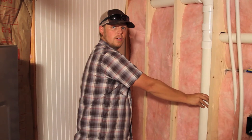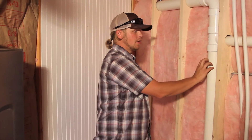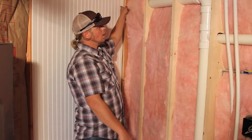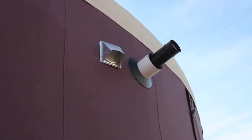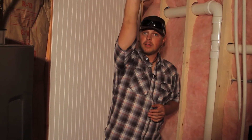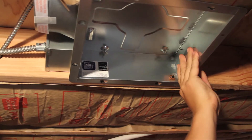This big pipe right here is your vent pipe. When you're going into a sewer system or a septic system, you've got to meet plumbing codes and make sure that the system is vented so it drains properly. This is going to exit out the exterior wall of the yurt. Sometimes we go up through the ceiling — we have roof jacks for that. Most yurt bathrooms are going to have a ceiling, whether it's floor joists of a loft or just a flat ceiling. You should also put in an exhaust fan that can be vented outside the yurt.